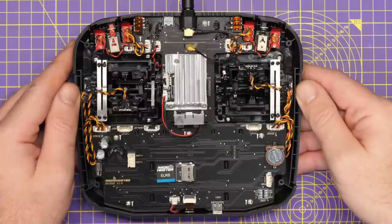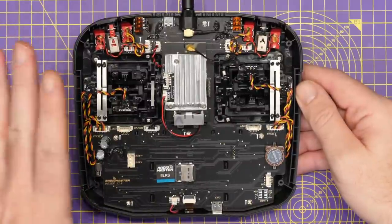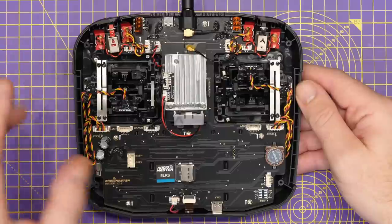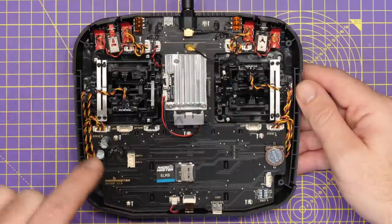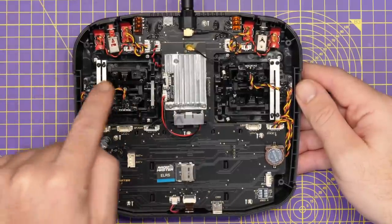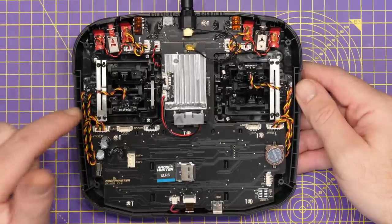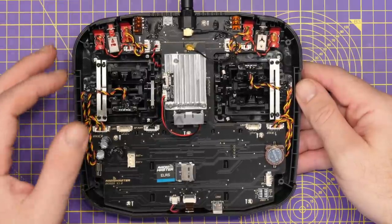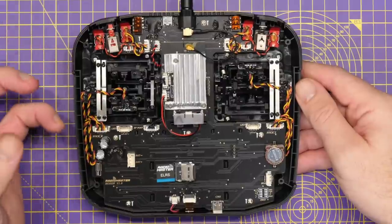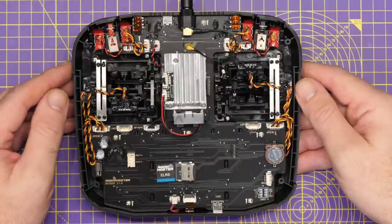Now, just to give you a bit of a sneak peek inside, I've lifted the back cover. If you were to take the radio apart, just note that there are no wires between the back cover and the main board, so you can simply undo the four screws and lift it off nice and easily. Looking around inside, we have our two gimbals either side. As I've said already, these are the V4s, full size, and I'm going to be swapping them out for AG01s in the future. Those are those lovely CNC gimbals, and if you're interested in seeing that, please do make sure you are subscribed to the channel.